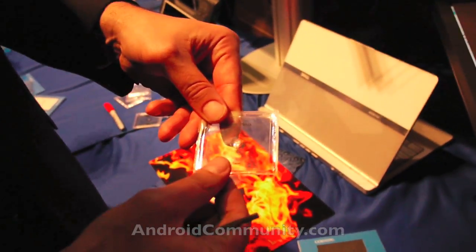Can you talk about the technology behind it? Sure. Basically, what we have is an alkali aluminum silicate glass. The alkali means that it has sodium in it. The way we make it strong, we put this glass in a salt bath, and it leaches out the sodium and replaces it with potassium. Potassium being a bigger molecule, when the glass cools, it sets up a compressive layer on the surface, and that compressive layer is what makes the glass very damage-resistant.